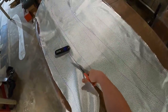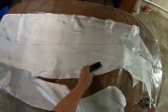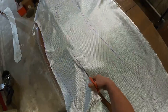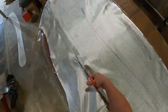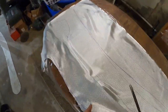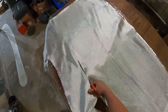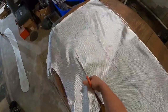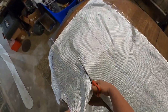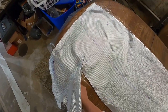When I took that magnetic brake and flipped that breaker, the other breaker popped — my main breaker popped, not just the 30 amp. I wasn't concerned because I was way far away from the tool. But when that 100 amp popped — it didn't pop in the house from the main panel, but it popped the 100 amp breaker out there at that panel.